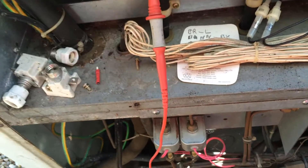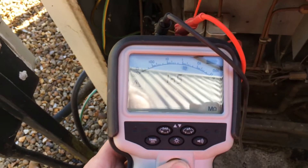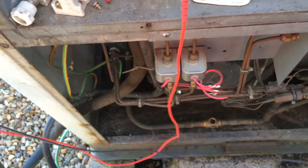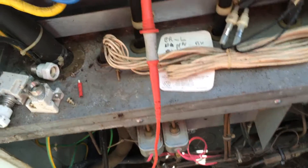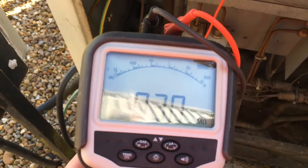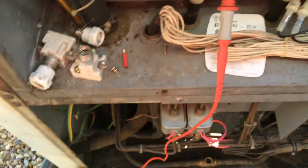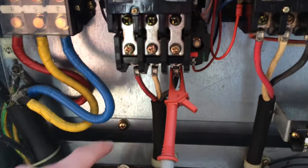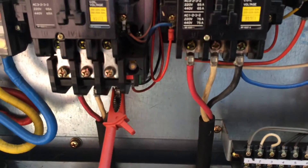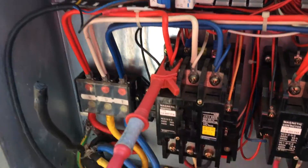We're all going to read as a short really if one's gone somewhere. Testing the third one - a bit short again. There's star-delta on this, so we've got one end of the three windings and that's the other end. We shouldn't have anything on there.